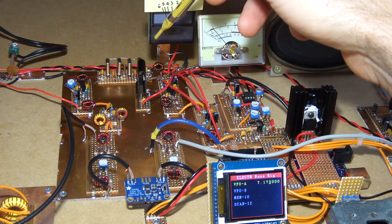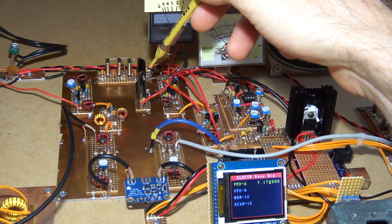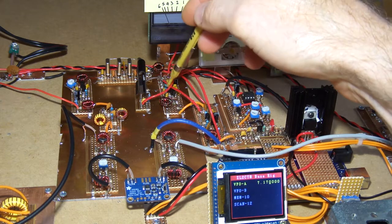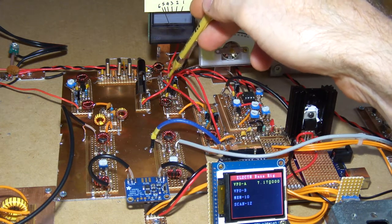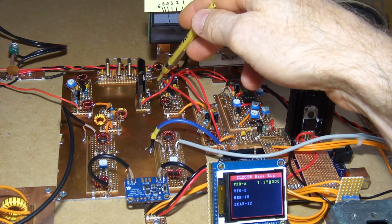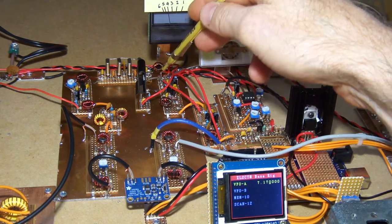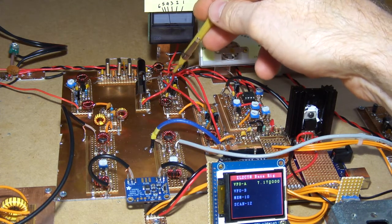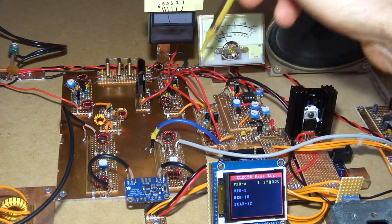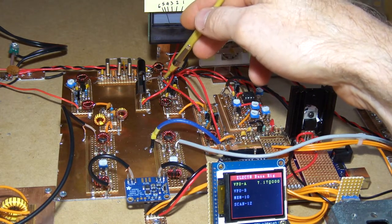After some comments - thank you very much - we've added an LM317, so that's now providing three volts to both the source resistors for the two amps. You'll recall prior to the LM317 we had four diodes in series - roughly 0.7 volts each, so four sevens are 2.8V. I've just set this notionally to three volts. As the voltage on the second gate drops off more towards the one-to-two volt region, we start to approach pinch-off and can shut down the gain of those two stages.